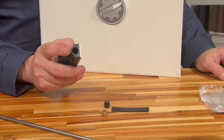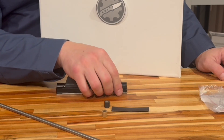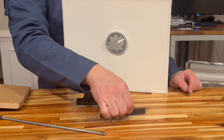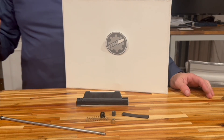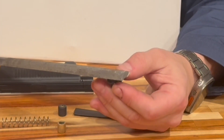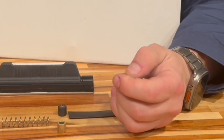On the carrier itself, there is a larger hole on the side opposite to where the bushings are installed — this hole is there to increase your stroke to sharpen extra-wide blades like cleavers. My mod will limit you to about 5-inch wide blades, or even wider as long as you don't mind higher grind angles. All we're going to need is a grommet, two bushings, a piece of heat shrink without adhesive, and a little ingenuity. For tools, you're going to need scissors and a file. I'm going to file the very end of the bushing — just to give it a little bevel on the edge — otherwise it's extremely hard to put it into the holder. I filed it all around; you don't need to do a lot of it.